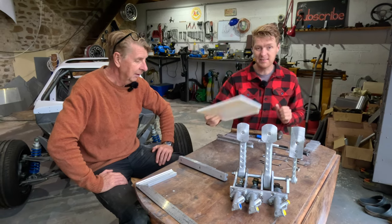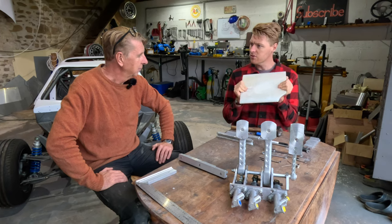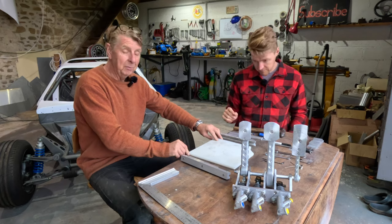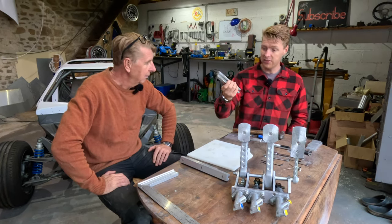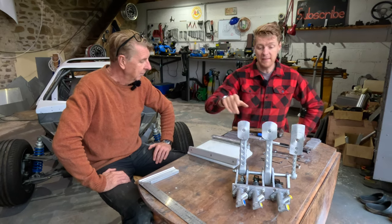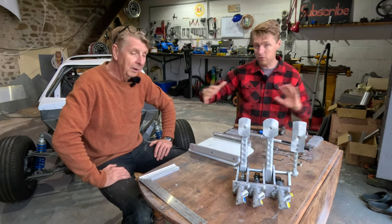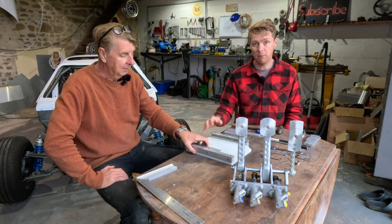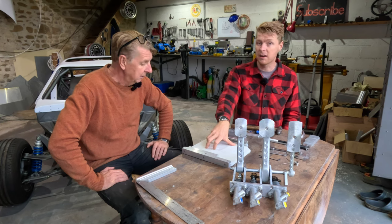And the thing is, even though nylon's not the stiffest thing in the world, it actually doesn't need to be, considering the forces involved. And it's also bolted to the floor, which is super stiff. It's bolted to 1mm bead-rolled steel, and then it's got these bolted to it, and this bolted to it, and then this will have a footplate on top of that. So as a unit, the whole thing is massively stiff enough. And we don't have to bother about dissimilar metals and stuff like that. And it might actually give us a little bit of isolation as well. The nylon, which is nice.